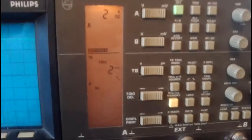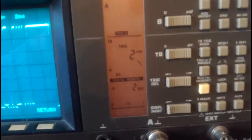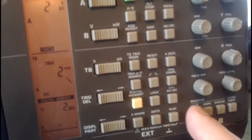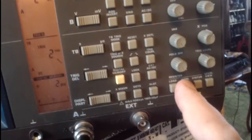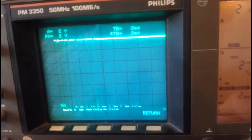I'd like to pick a section of the signal out to have a look at. To go into digital mode, you press the white button to bring the digital store up. The image currently showing on the screen — the 'A' at the top tells you it is the active incoming signal, as you can see changing samples of that. If I press load here, that would keep the picture that was on the screen. Going on to display, it's now changed to show 'A' and 'RA' — having pressed that button once, 'A' is the active signal and 'RA' is the stored signal.